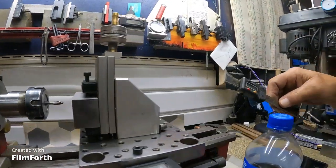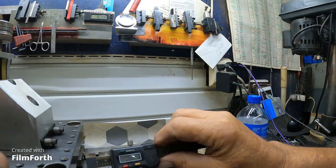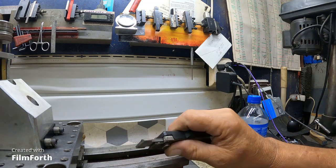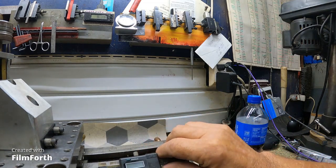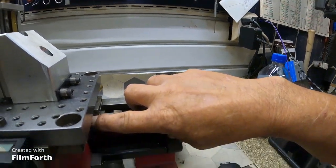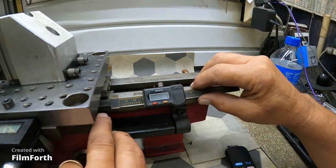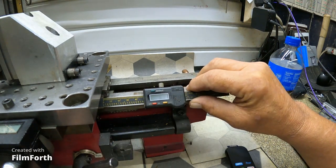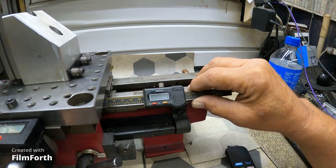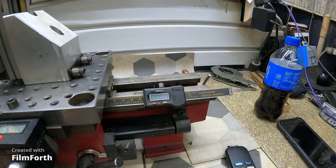And I'm going to be hooking up my travel gauge here on the lathe. So this magnetic, I got to get some new magnets. Usually two magnets behind here, one magnet on this face. Let's go down here. And basically, the magnet here on the carriage grabs this and it marks my travel, so I can make accurate cuts with the mill cutter.